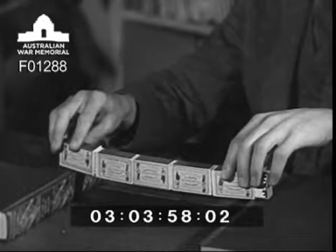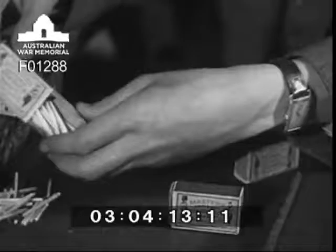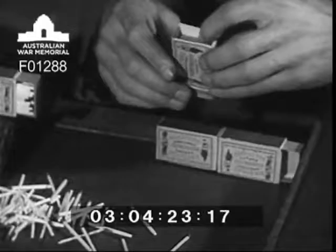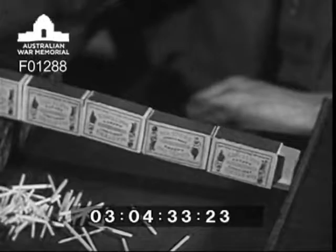The first is that when it was halfway over, it would have fallen into the gap. Now, this is how we overcome that one. I'll empty the matches out of these three boxes. And they, being lighter, will represent bays of the bridge built in the lightest possible manner. That is, omitting non-essentials, such as decking and the like. They are attached to the head of the bridge. Now see what happens. The bridge has reached the far side without tipping up.